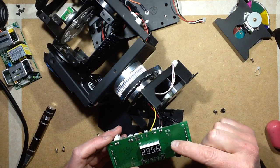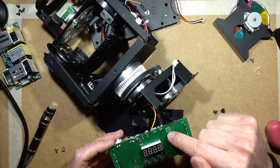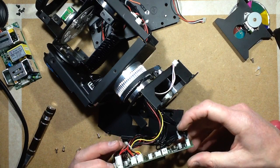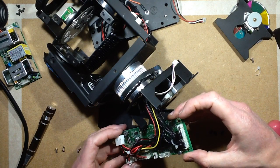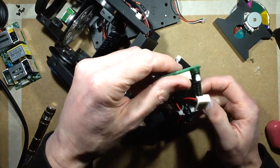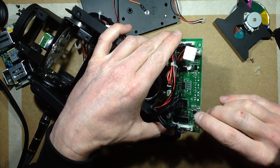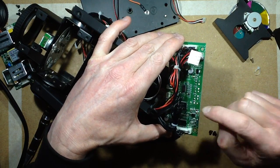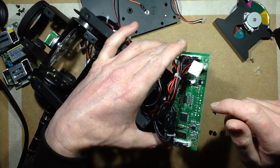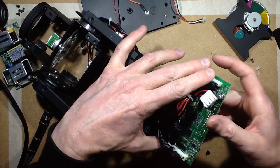It does seem to have an infrared sensor. There was a hole in the front, so it seems to have an infrared sensor positioned there. So you can change parameters by remote control, I guess. The microphone has a little 8-pin chip in the vicinity. I think we can reasonably assume that's going to be an op-amp with a little bit of support circuitry. Probably gain control from the chip, I'm guessing. Voltage regulator. Not sure. Oh, that chip's for driving the display.